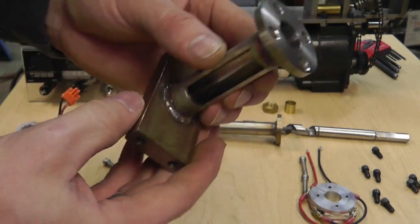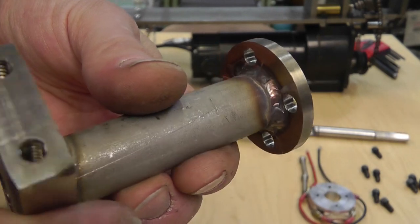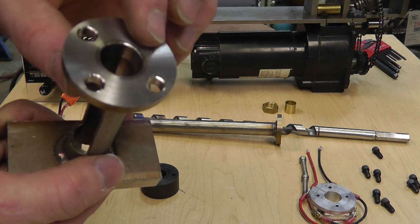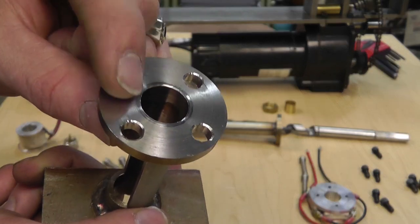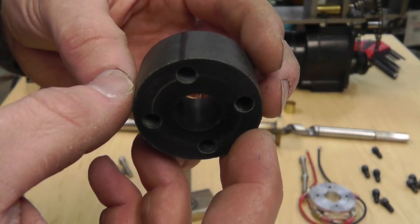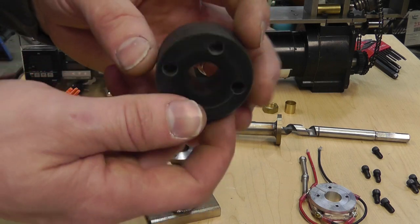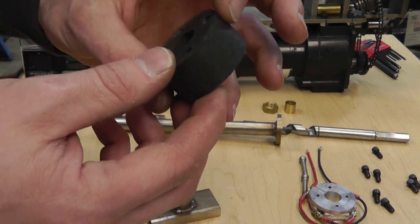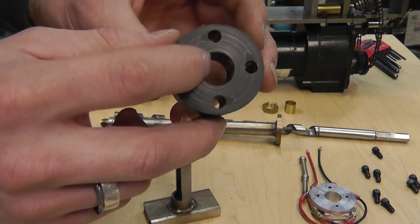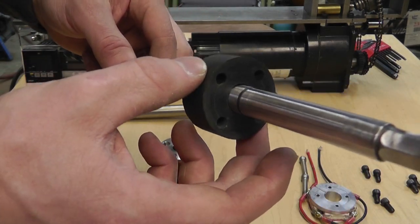All stainless. I think I did a decent job — the welds aren't that bad. I had to go back and machine the edges off, but these did go all the way into the tube, so the tube is actually part of the fitting or flange you see there. Here's this material — I don't know what it is, it's some kind of Bakelite but not as brittle. It holds heat well for separation, and that hole happens to be exactly the right diameter.